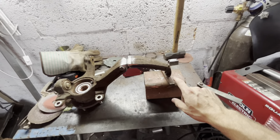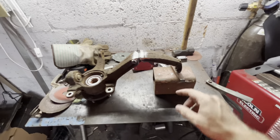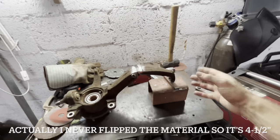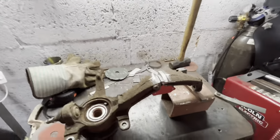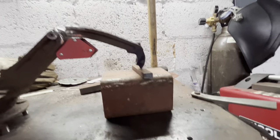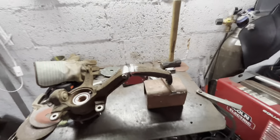This spindle is ready to be welded. This was a six and a quarter, and right now this is at four and three quarters inches. So I'm going to tack it on either side and then double check that measurement, and then start making some welds. I'm trying to keep that right at 4.75 or up to five inches - it could be somewhere in between.